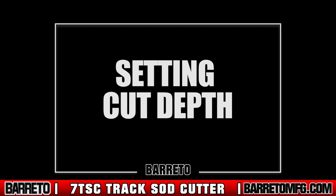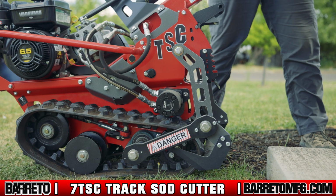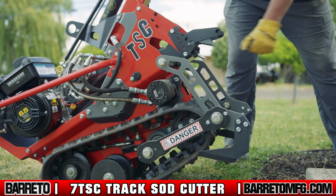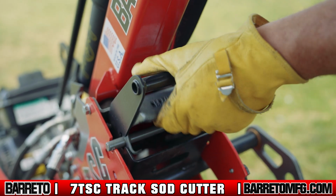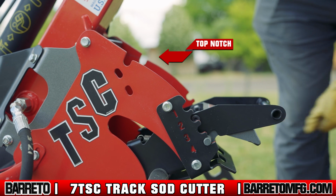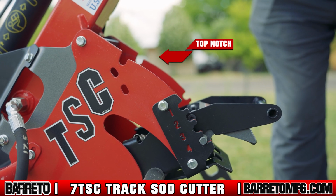Setting cut depth. The 7T Sod Cutter has a very simple depth adjustment. Simply lift the back of the machine, squeeze the depth paddle, and unlock the depth arm from the top notch. The top notch is used for transporting or moving the machine around the job site.